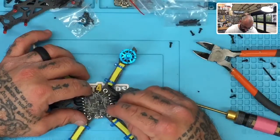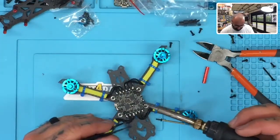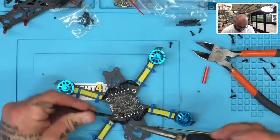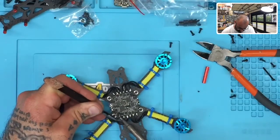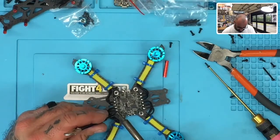And here's the standoff, and I know the standoff shouldn't hit, but I don't like the way it's sitting, because if it's really stressed on that wire, the wire is going to break. So what I'm going to do is take this out. I'm going to actually bring this wire this direction, and I'm going to come straight from the outside area, just like that. All right, I'm going to correct all of these because they're all going to need to be done the same way.